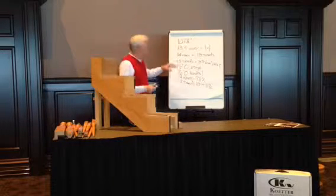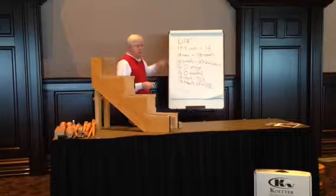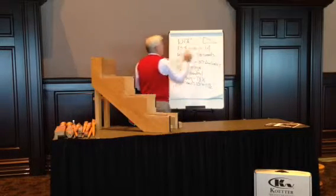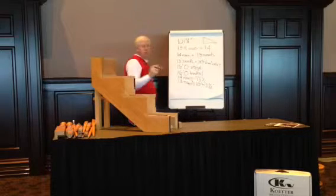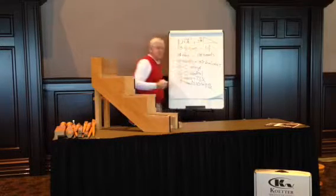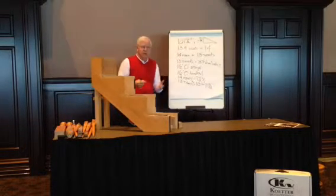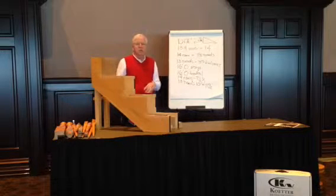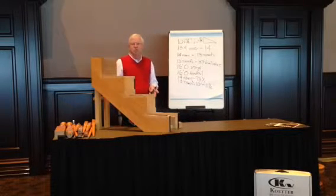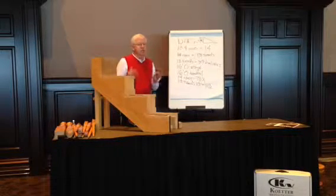We've done no math except this: how did 107½ inches give us 13.4 risers? I know in my triangle that each individual rise can be no more than 7¾ inches tall. The traditional range is 7 to 7¾ inches. To keep it simple, you divide 107½ by 8 inches — that allows you to use whole numbers without dividing by fractions, taking all the complex math out of it. We get 13.4 rises, and we're going to round up. These are general field guidelines — you may need to adjust for your specific local code.